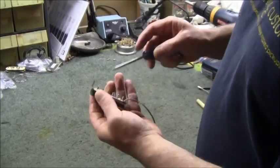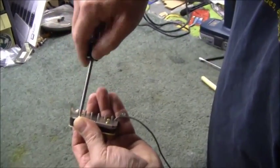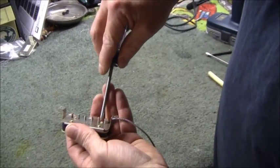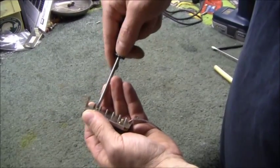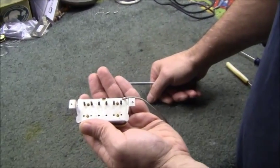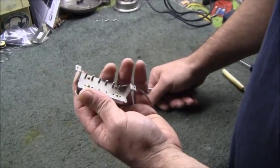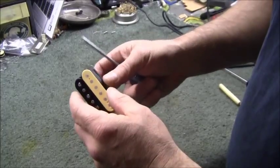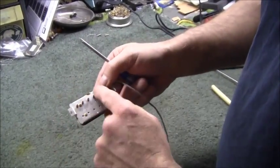To start, the first thing you need to do is loosen the four brass screws on the bottom — about a turn or so is all you need. In the case of this particular humbucker, it's an embossed patent sticker, patent number humbucker. This is one of the ones me and Guitar Freak 82 put together some months ago from leftover parts that were all new — genuine Gibson bobbins that were pre-wound. First things first, we loosened our screws.